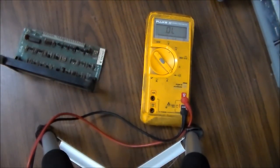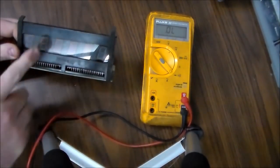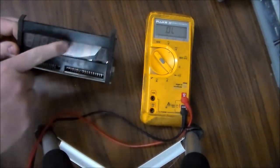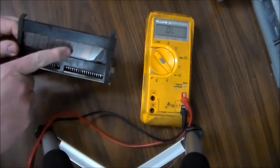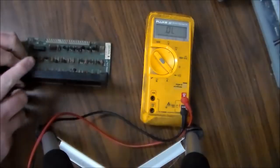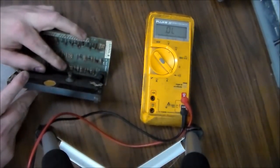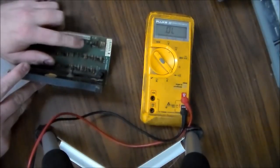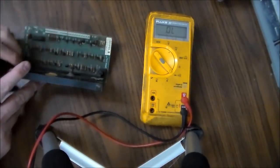All right, so now that we've re-soldered it, remember it was the fourth digit, which is actually the hundreds digit, so that's like the ones digit, the tens digit, the hundreds digit, right? So it's either this transistor or it's this transistor because it's stuck on. If it was missing, we'd look at the resistors.